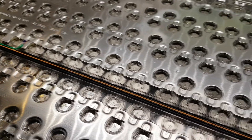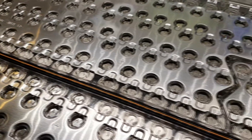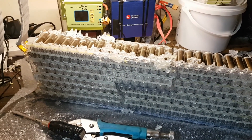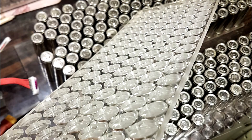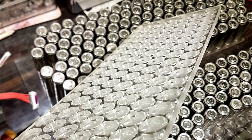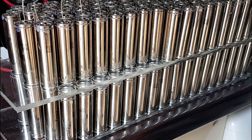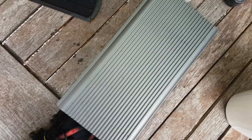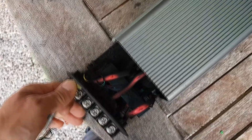I built the battery from a Tesla Model S module. It took me probably two days to strip it down — the glue is really, really hard. I used 6-millimeter Plexiglas to build this battery; each cell is separated one and a half millimeters from each other. It looks really nice.